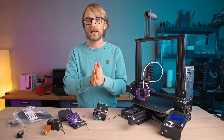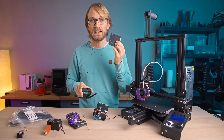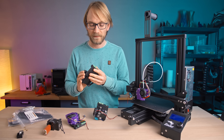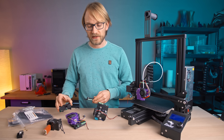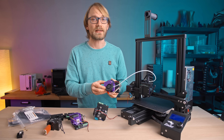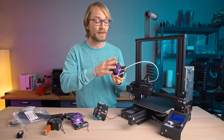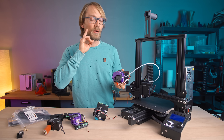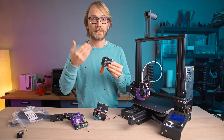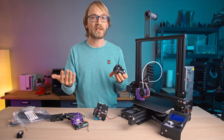Here are two things I'd like to consider before you head out and buy one of these. With just the base kit and just a single mobile plate, unless you print yourself extra plates — for example a pen plotter — you don't actually get a quick-change system, you just get a quick removal and reinstall system. The official use case for that is being able to take the hotend and extruder off of your printer and being able to work on them outside of the machine. But with that, you're essentially planning for failure — planning for having to service your toolhead as it keeps on breaking. My thinking is, in that case, why not plan for success and instead of a quick-change system, invest in something like a Hemera and just put it on without any plates, which is simply not going to need as much servicing.